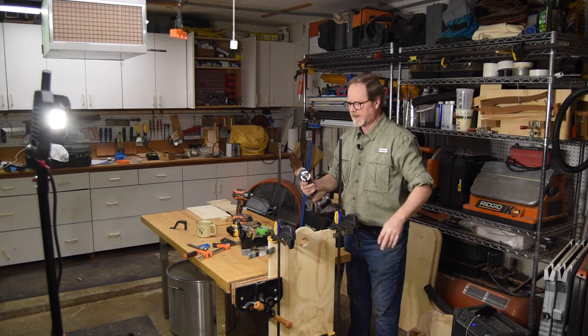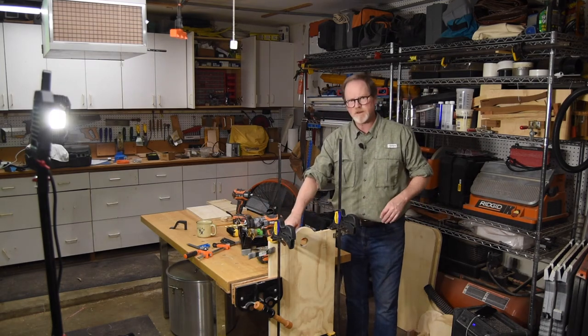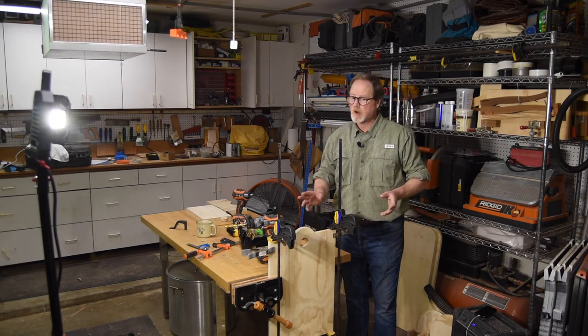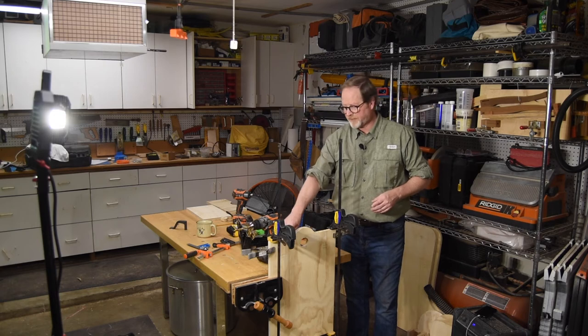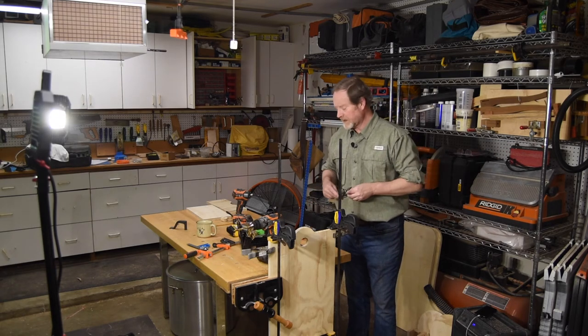All in all, I think I like it better. I think the brad point was better to start out with, but as far as following the hole all the way down, I am a little concerned with how this is going to come out. Hopefully, it didn't wander off too much or cut away at the sides of the hole that was there. This twist bit did a much better job following the existing pilot hole. Something to keep in mind.